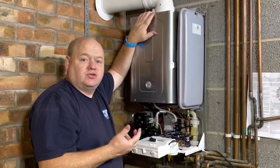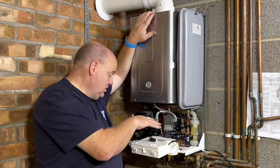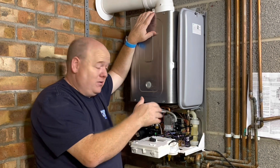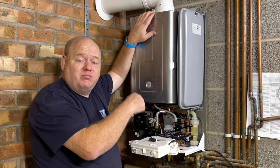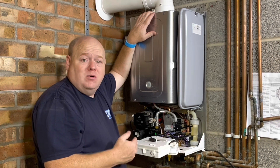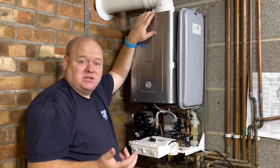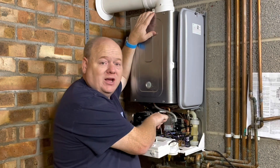You just adjust that - turn it slowly. Obviously you've changed the board to minimum so that you can do your minimum reading. Then it may be that you want to go back, press the buttons again, go back to maximum on hot water, make sure that's still okay, and then maybe go back to minimum if you wanted to. But that's how you would adjust the gas valve.